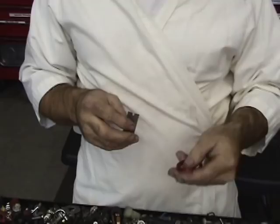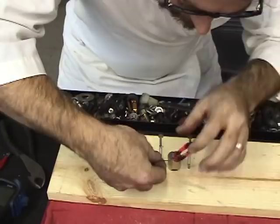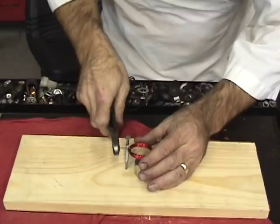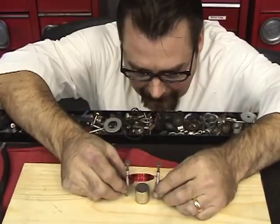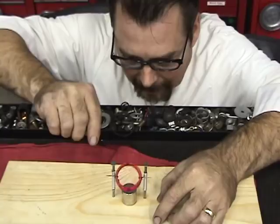Okay, so then you're going to slide that guy right in there like that. And right in there like that. Okay. Now you're going to take your handy dandy wire cutters and trim off what little wire you got left on the outside there. Not too much, just enough to keep it from imbalancing. And then you're going to get those to sit right there. You're going to try to balance that coil right on top of that magnet there. You can feel the resistance there. And then you're going to give it a push. Come on. Come on. And voila, look at that.